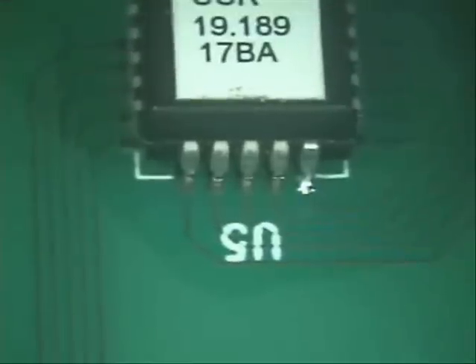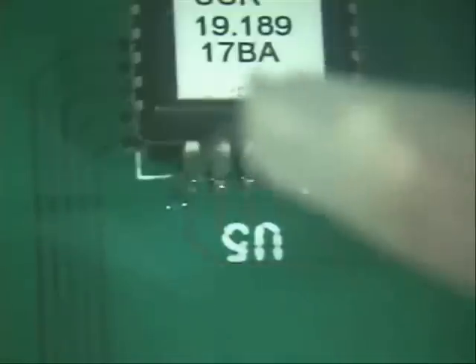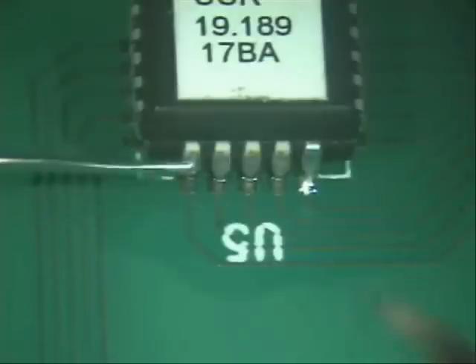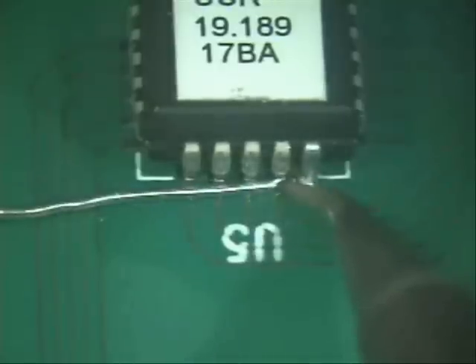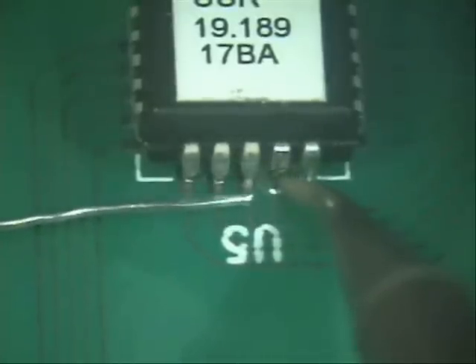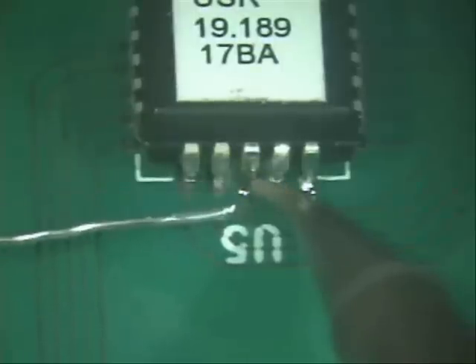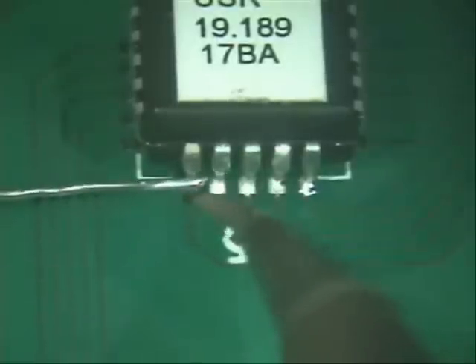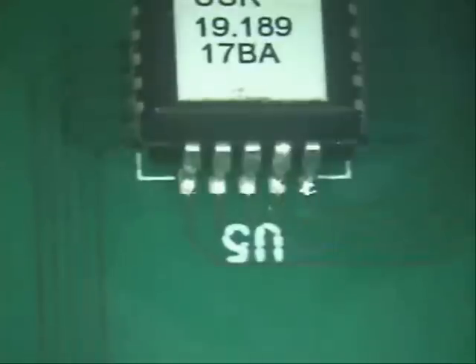The other side — come in and focus a little bit, just like so. Come back in and apply a little bit of flux. Lay your solder down into the area where you're going to solder, just go past that leg a little bit. Solder will flow in — go through the solder. You hesitate when you come onto that lead just a second, then one right after the other. Now you've got that side soldered completely in place.